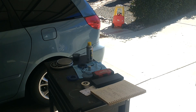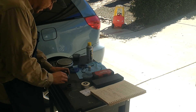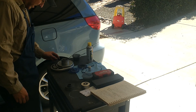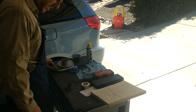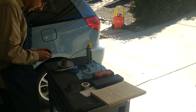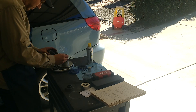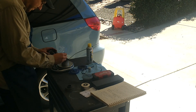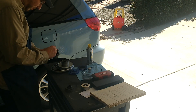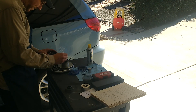So I'm going to do the first test on that now. I need 10 and a quarter grams. This is a 90/10 pre-alloyed bronze powder sold for powdered metal parts. And in addition, 5% by weight graphite.